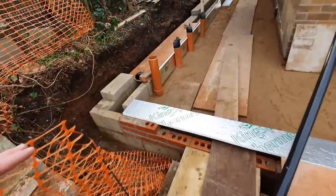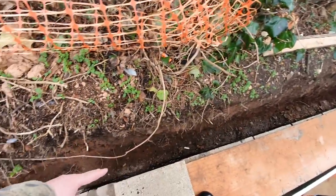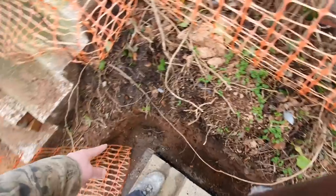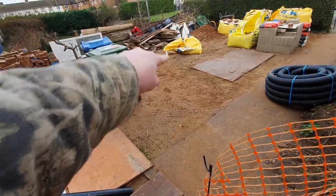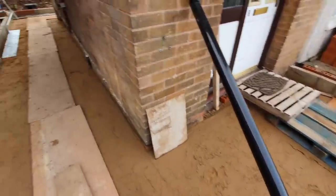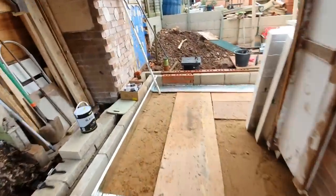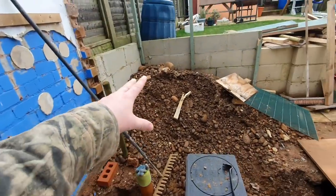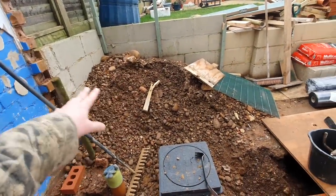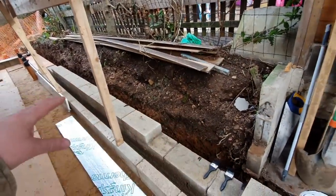This will sit in the trench down here, come around this corner, and sit in a bed of gravel. Any water that collects will run through that perforated pipe, come across here, and ultimately be connected up to our surface water soakaway, which we'll be digging in the middle of the garden. There is one there already but it's just filled with rubble and not very big, so we're going to put a big one in. We've got some 20mm clean gravel to go over the top of the French drain, and then we're going to backfill with slightly dirtier gravel that we used when we graded off the sand we excavated. Clean gravel initially to make sure no soil blocks up the holes on the perforated pipe.